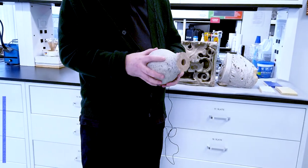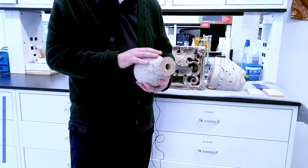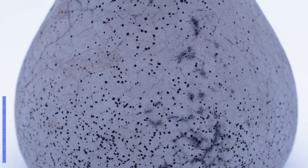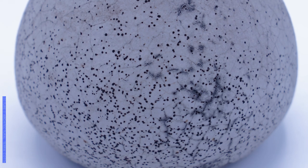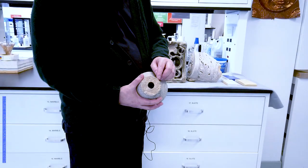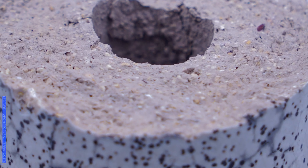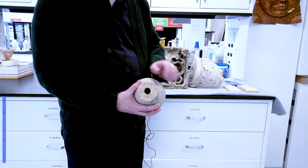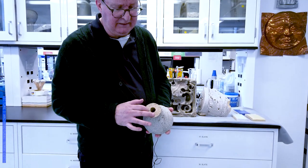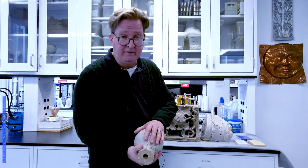It's an effort to make this substitute material look like limestone. The way it's done is to apply a liquefied clay — not a vitreous glaze, not a glassy or shiny glaze — but a liquefied clay to the surface before firing and then fire it. These little flecks tend to add to the impression that it's limestone. The slip coating is really only a few micrometers thick — it's really skin deep. And that's the case with all terracotta. Almost all terracotta has a body similar to this, but is dressed up either with a slip or a glaze.